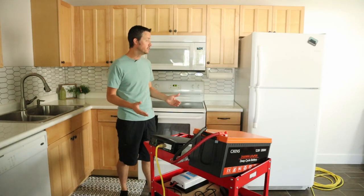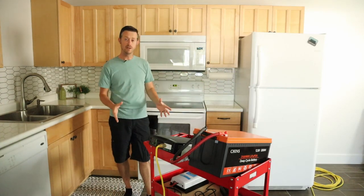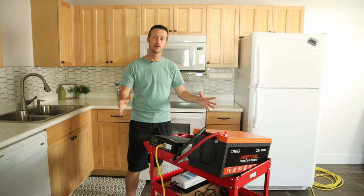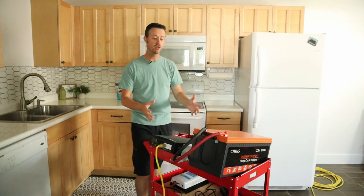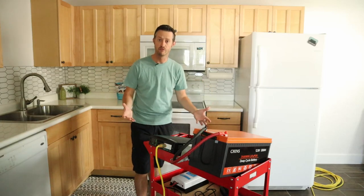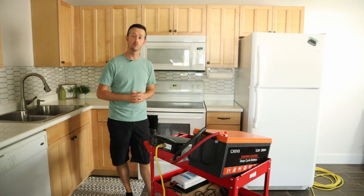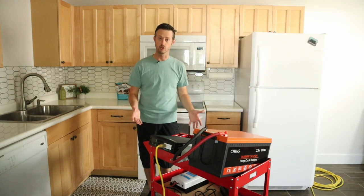You could add additional things — a secondary fridge, a microwave, or other appliances. The best thing about a DIY setup like this is you can always expand. You could add a second battery for a lot more runtime, or add USB ports and 12 volt sockets to charge your mobile devices or run 12 volt gadgets. The options are endless. You just have to start with three main components: a battery, an inverter, and some sort of charger.